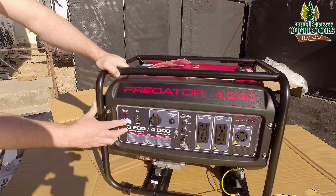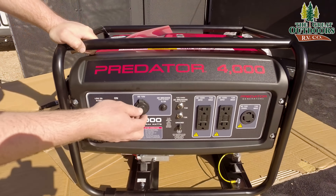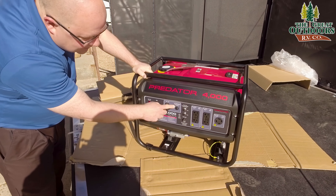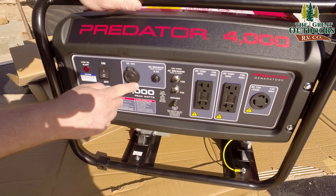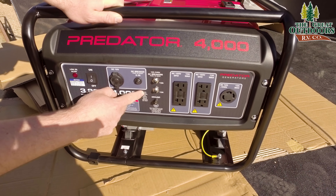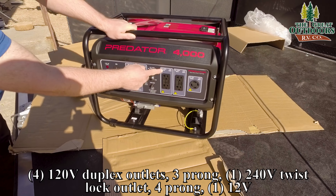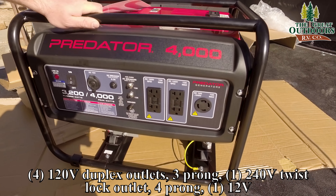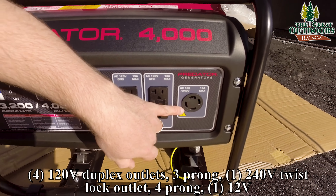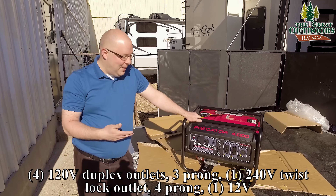On the front you've got your low oil alert and your on/off switch. As far as I can tell there's no gas cutoff yet. Over here is your 12-volt receptacle and its breaker — 8.3 amps, which feels pretty decent for a generator pushing 12 volts. Here you've got your 120 and 240-volt AC breakers at 13 amps each, plus a ground. And then you've got two 120-volt, 13-amp receptacles. We were talking with some of our techs who came out to look at this.